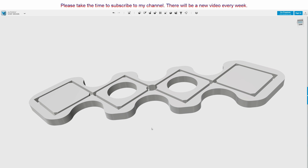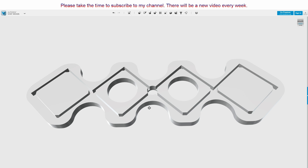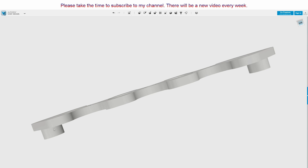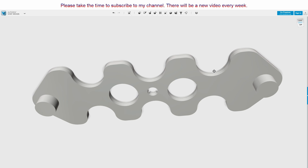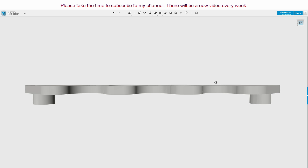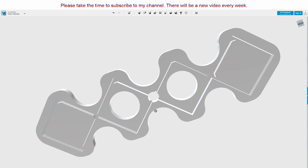There is another thing: the antenna has to be placed on a reflector, and the reflector has to be a metal plate. If you do it correctly, your bi-quad antenna is placed one centimeter away from that reflector. So I created something to lean on, so I know for sure that this antenna is placed one centimeter in front of your reflector. First I started to print this thing — let's take a look at how this is printed.